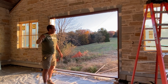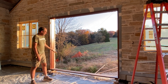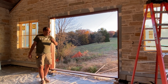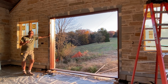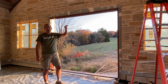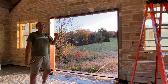After getting the small door done on that side of the garage, I started working on the big French door set. I have the frame in — I've used a laser to go through and check, make sure it's plumb and level. It's up four inches off the ground because they're getting ready to pour a subfloor in the garage. There's actually a garage underneath here, so it's extra thick and extra strong so they can park on top. This is going to be four inches up from the subfloor. I'm getting ready to put the doors up, but first I want to get the frame set. For a smaller door, you might put the frame up with the door, set the hinge side, and then adjust the rest of the frame to match the door so it fits nice. In this case, the doors are huge and hard to work with, so I put the frame up first.